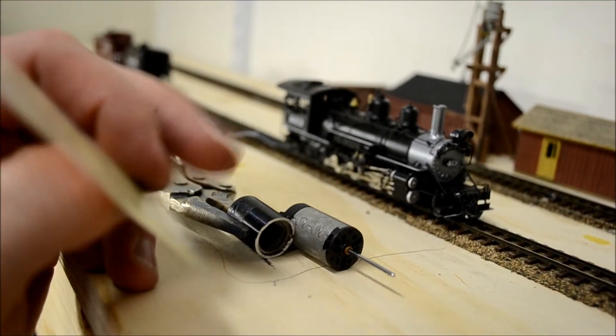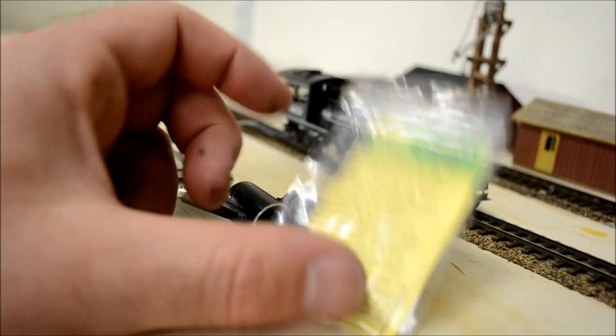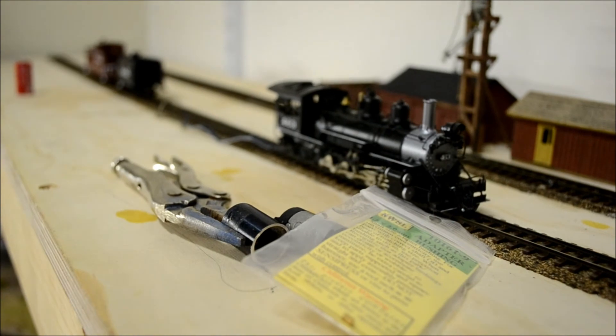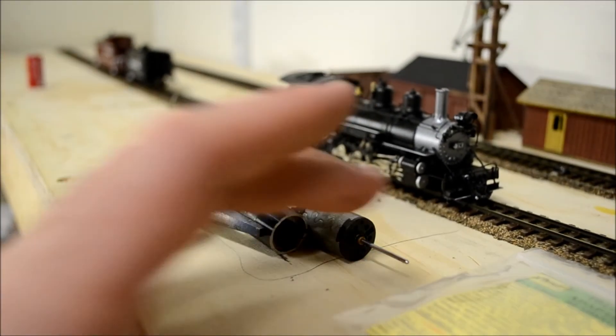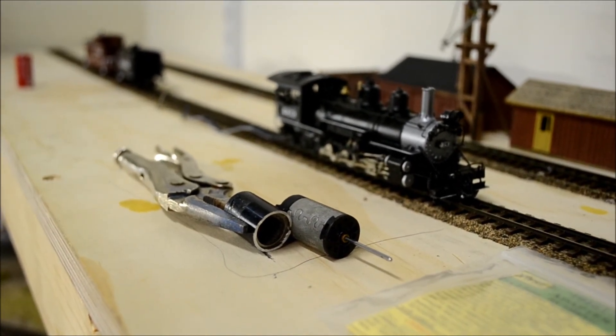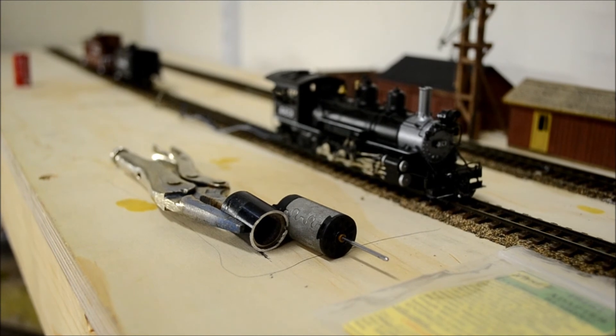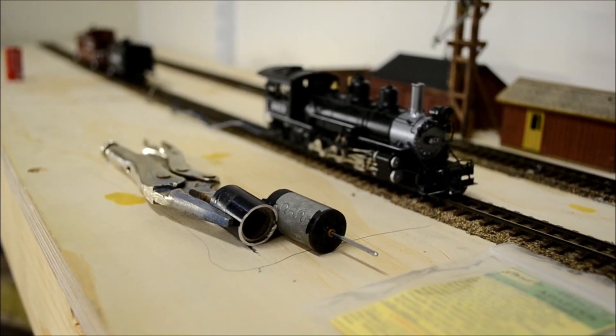You only really need two of them, though I order extra because I tend to mess stuff up on the first try. Once you put the bushing on the motor shaft, the worm gear will slide right on. I just use a little bit of glue to hold it on. It holds secure, then you can snug the worm gear up and set the mesh on it.